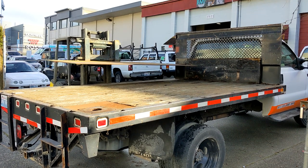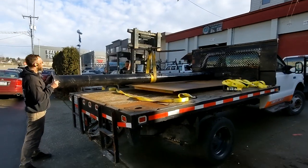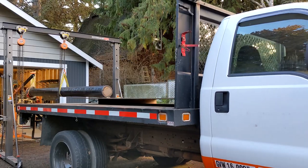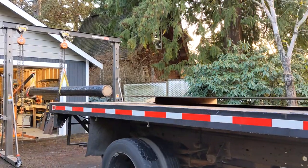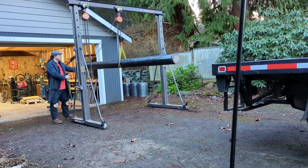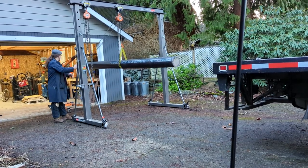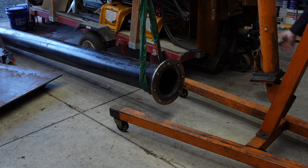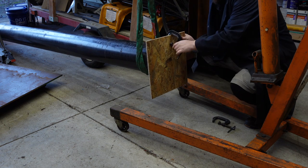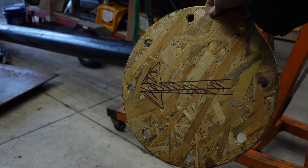After getting the basic design signed off on by my structural engineer, I outsourced the welding of the mounting flange onto the central column — that's the kind of thing that really needs to be done by a certified welder. I picked up the half-inch steel plate, which would serve for the bird body and gusset plates. This was in early February, with installation scheduled for April. First up, getting a template for the mounting bolts made to be sent over to Spokane so the concrete pad could be poured. I clamped the plywood onto the flange itself and used a Forstner bit as a transfer punch, then drilled the holes out.